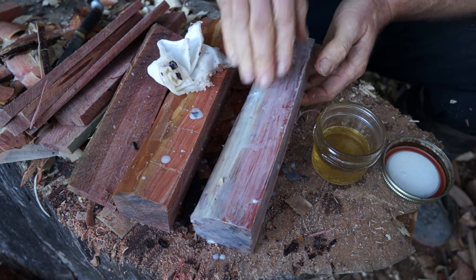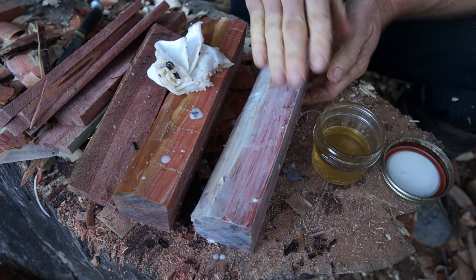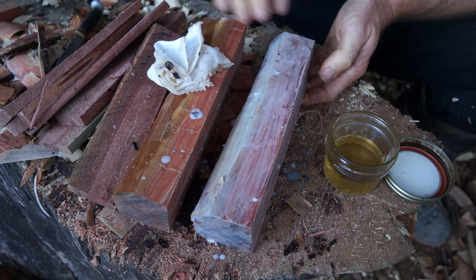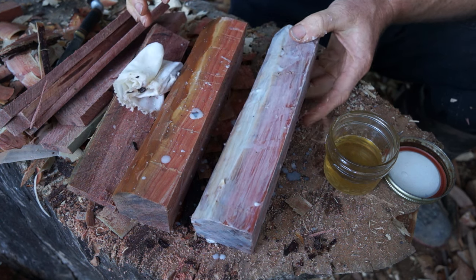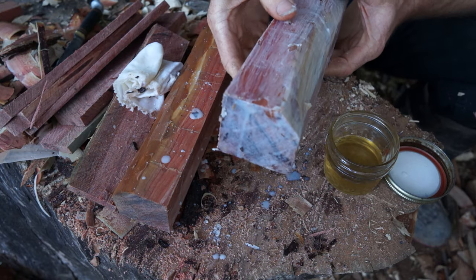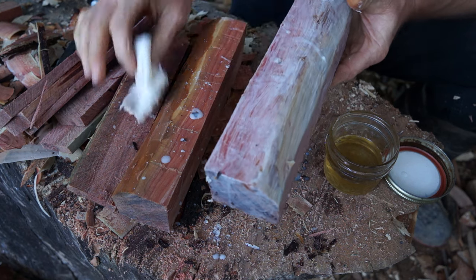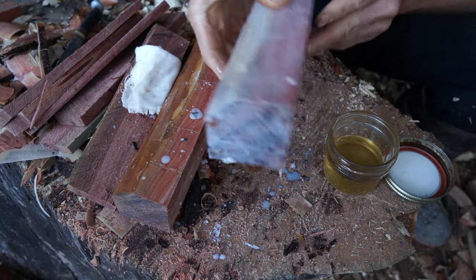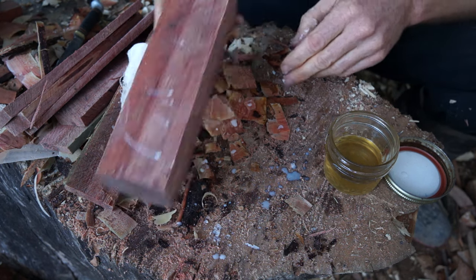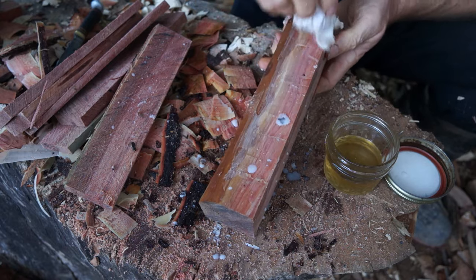So, I was saying, even if this gets hot repeatedly, and the more liquid fatty acids in here soak into the wood, it'll still leave a coating of what I think is stearic acid, which is an extremely saturated, very waxy fat, and it'll leave that still on the surface. That probably isn't gonna happen to this because it's winter and these are gonna dry pretty slow. Eventually I may bring them into the house, we'll see. But this will season out almost for sure without cracking from my experience, which is considerable putting up lots of wood like this for my lathe.